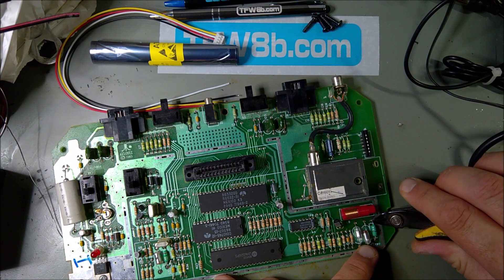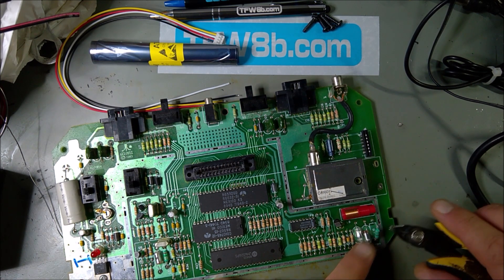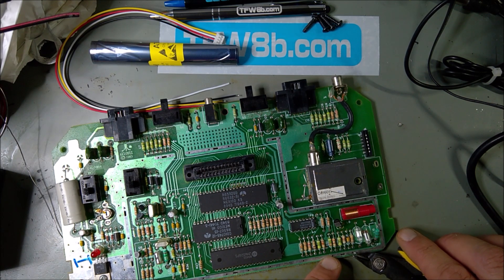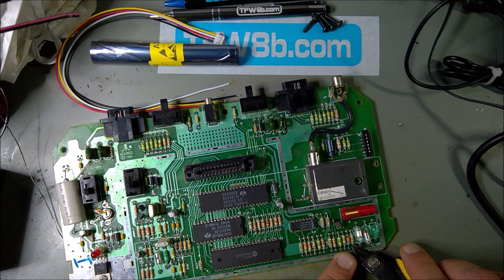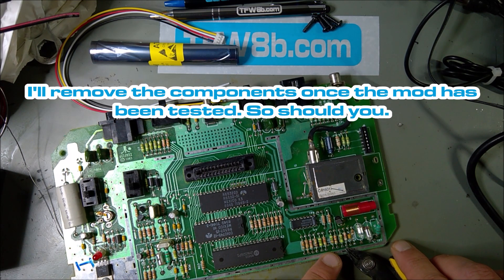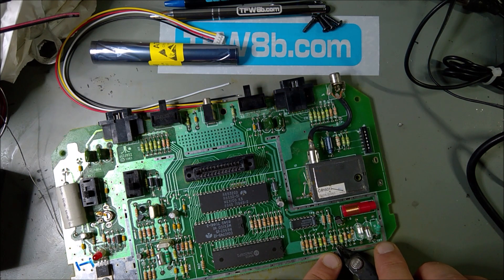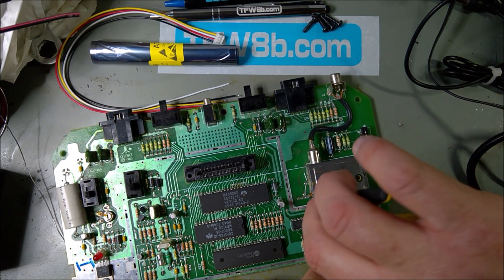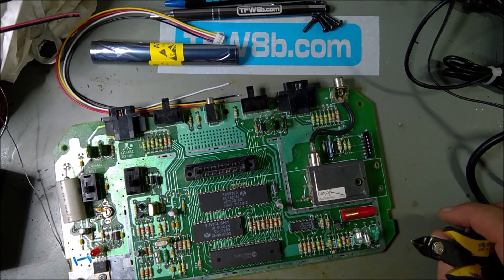What I'm doing here is just cutting one leg — because that way if you think you've made a mistake, you can soon put this back to how it was with no particular drama. So yeah, this one needs to come out here. I'm just going to bend that out of the way. That's coming from the long trace down there. I need to cut it from the top side, not the bottom. So that's that one out.